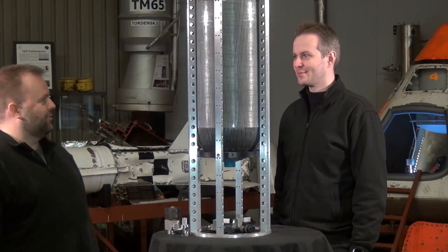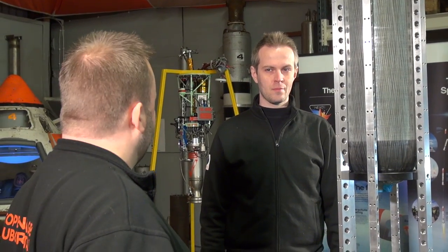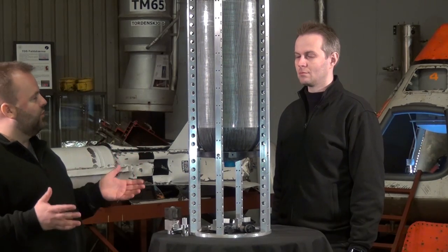So this is the second topic today. This is the brand new thing for this year — this is the so-called DPR section. Again, a modular unit, one of these standard components we can put into the rocket more or less everywhere we choose. All the mating flanges are the same, so we just need an engine in one section and a tip in another and we can basically juggle all the components. What the DPR section does for us this year is bring a lot of extra helium along on the journey upwards. This is a 300 bar lightweight pressure vessel which is 20 liters — so with 300 bar it will contain about 6,000 liters of helium.